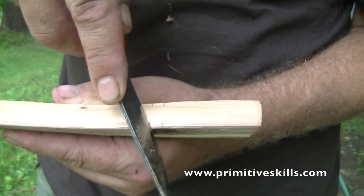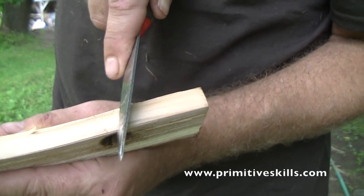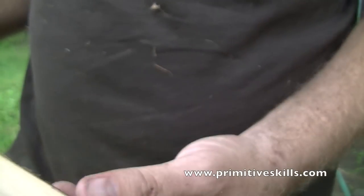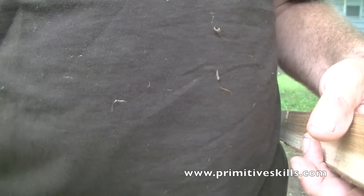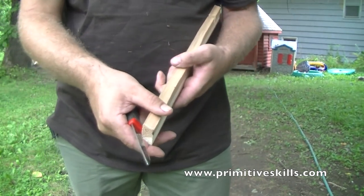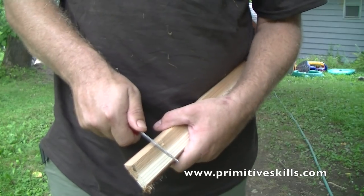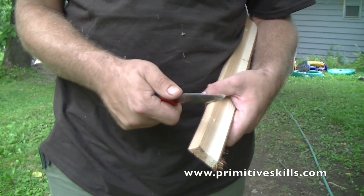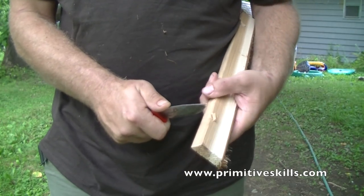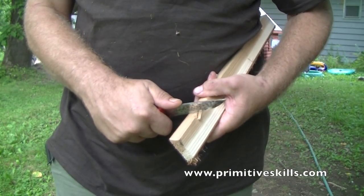I'm going to kick out the bottoms — mark it out to here, mark it out to there. Now I have to use a regular hand position for carving because this is pretty tricky. From here you carve by slicing, not by plowing. Plowing is pushing straight in. With the slice, I hold my knife steady with a thumb brace and I try to line up those two canted marks.